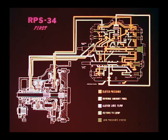Pressurized oil is also directed from the selector spool into the C2 pilot circuit, which is routed through the C2 shuttle valve and the opened C2 retard valve check ball. The C2 pilot is actuated, permitting pressurized oil from the supply gallery to pass through the pilot and into the C2 clutch. The steering return oil enters the valve body and flows by the clutch spool to the pressure regulator.